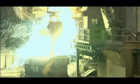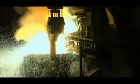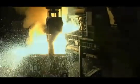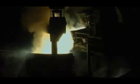While being melted, oxygen and other unwanted elements are absorbed and removed by the slag. Desirable elements, chromium, molybdenum, manganese, and others, are added to begin creating the proper chemistry to meet customer specifications. When the chemistry is right and the steel reaches 3,000 degrees, it's tapped into a transfer ladle.